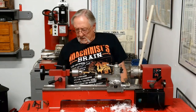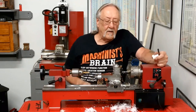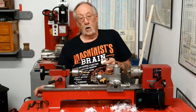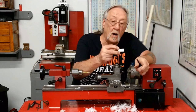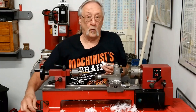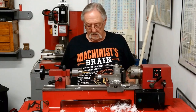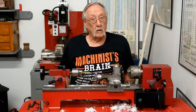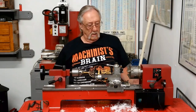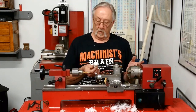Well, let's see. I have a 5/8 end mill. 5/8 just makes it. So while I still have something to grab onto, I need to turn this down to maybe 620. It is important. I should do a little bit more checking. Let's see, where is my chuck key? Okay, let me regroup here and we'll proceed.